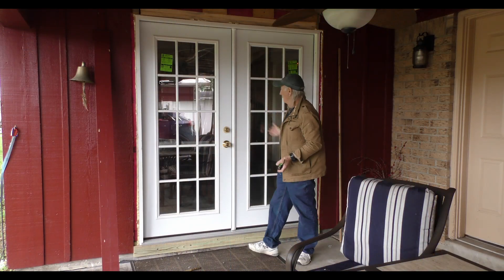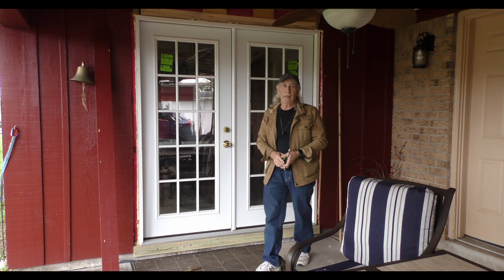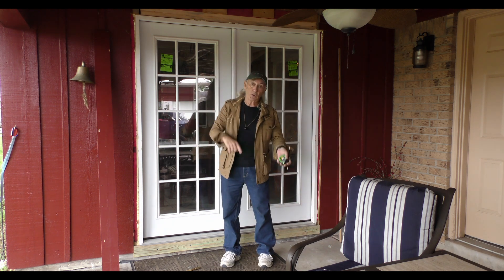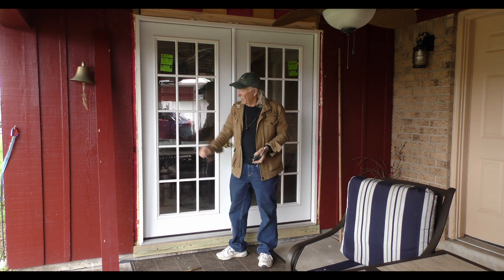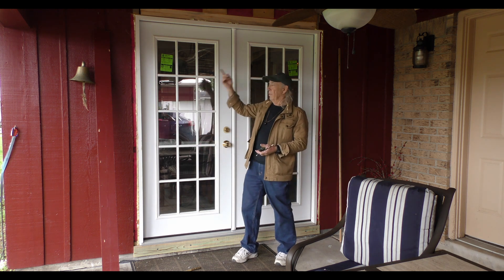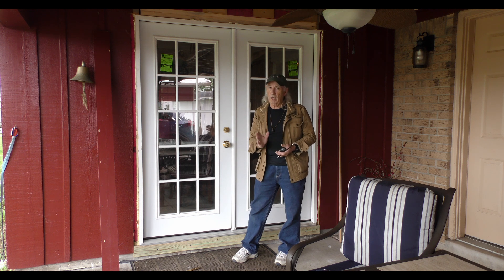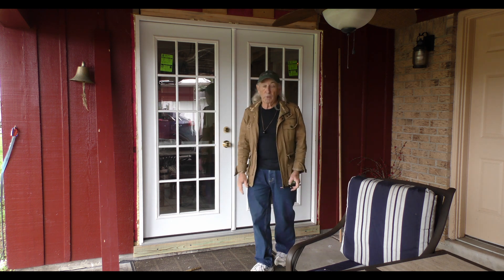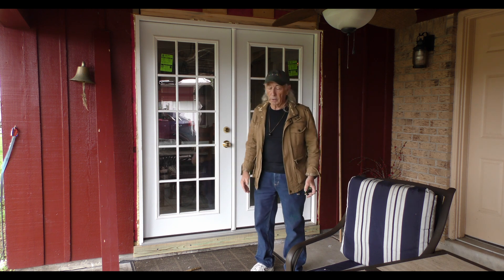Here's the new French door set. This is a common size, so you save a huge amount of money by just buying a common size. The problem was the studs in the wall and the header were all sized for the old door set. We had to run a new header, cut the studs, and cut back into the wall to move everything. We basically reframed from the outside, while from the inside we only cut the drywall — nothing else was disturbed on the inside. The project went off really well; it was almost mission impossible, but we managed to do it.